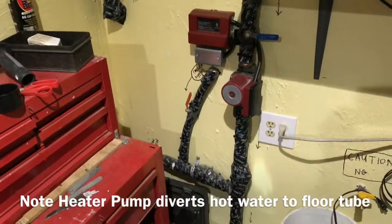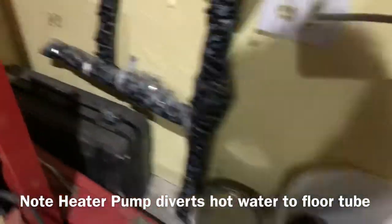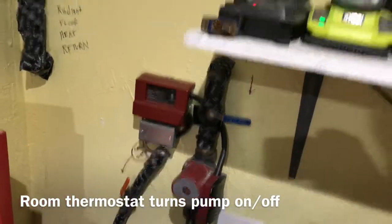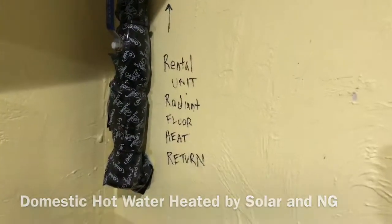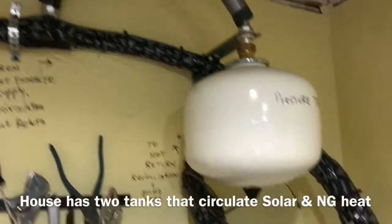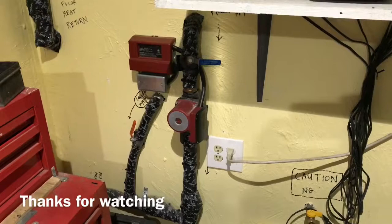Months later, here's the hot water heater, the pump, and the activation switch. There's a cold supply going in, and then it enters the radiant floor down there. It has a recirculation that comes back over here — there's the domestic hot water from recirculation and solar. The radiant floor return comes through the wall from the roof, comes back up and over to the hot water storage tanks. The solar and the natural gas fired unit pushes hot water into this tank for storage during the day, and hopefully it pretty much takes care of the whole thing.